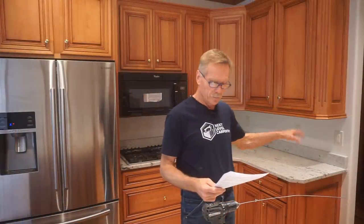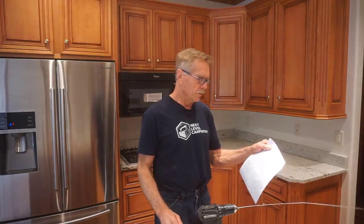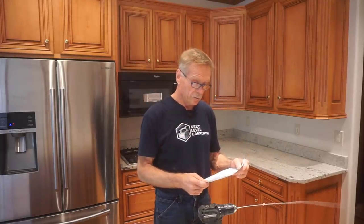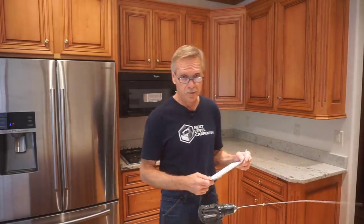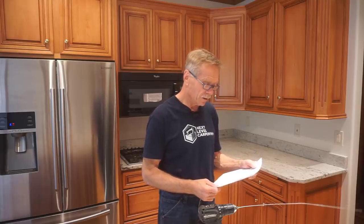In this case it was very simple to drill through, but this same wire can go through tile grout, underlayment, and carpet on floors. Because this wire is smooth, it doesn't ravel a carpet — it just pokes right through. That's especially important on something like a berber or loop pile, where a drill bit can destroy a piece of carpet in two seconds. For walls, it can go through sheetrock, sheeting, insulation, and siding on exterior walls.